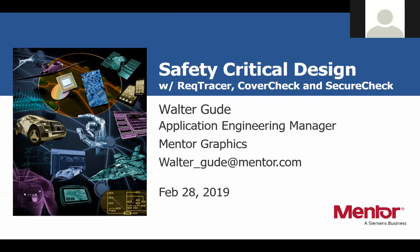So safety critical design, in general, what is it? Why is it important? It basically started out, I would say, maybe a decade ago in the aerospace world, and really in the civil aviation world, with the DO-254 standard, which was kind of the first safety critical standard that was applied to an industry for FPGAs.